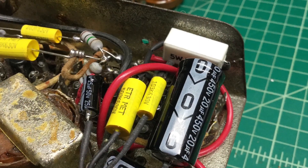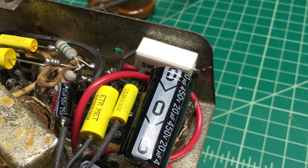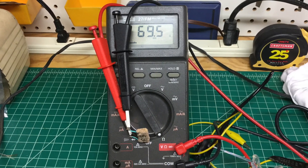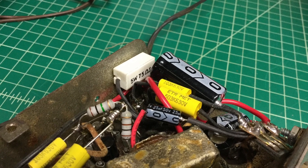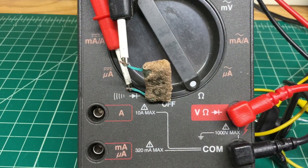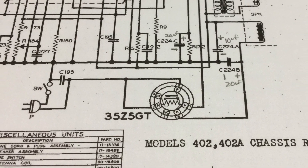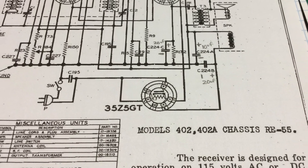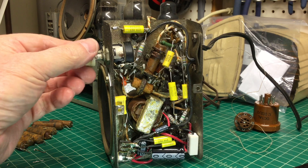You may have noticed that I replaced the original power resistor — the dropping line voltage resistor for the filaments. You can see it reads around 70 ohms, and I replaced it with a 75 ohm 5-watt resistor for now. The original connection point for that resistor was between pins 5 and 7 on the 35Z5, connected between the heater and the plate — the plate actually being the input line voltage — so it was used just to drop the voltage for the filaments of the tubes.